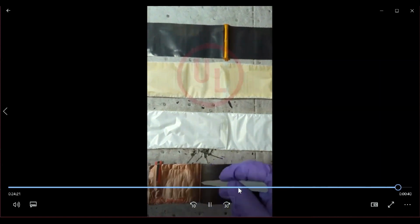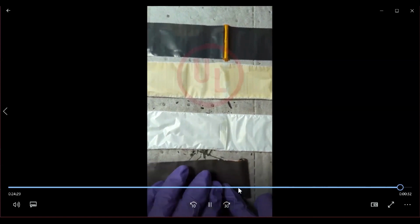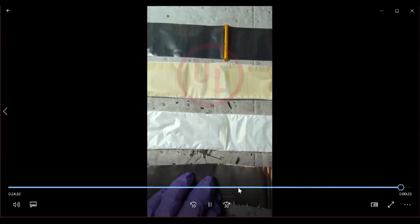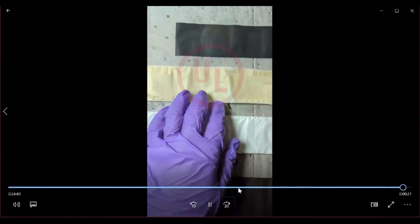And so we are coming to the end of our video. I would like to reiterate again that extreme caution should be used while opening up the cells. Although your cell has been discharged below 1 volt, making it safer, you still have liquid electrolyte inside the cell before the electrodes dry out. So you should not work too fast or in a careless manner, in order to prevent any type of short circuiting that may happen.